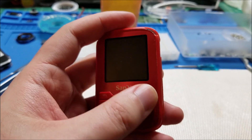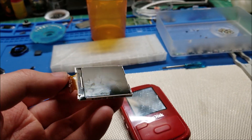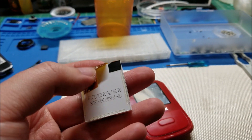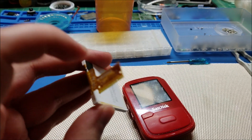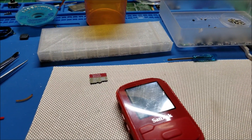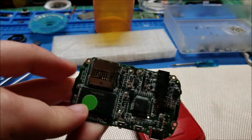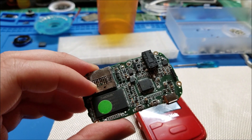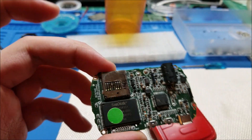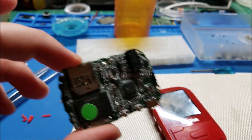When I first opened this, I wasn't even planning on making a video — I was just going to fix the screen, which I did replace. I desoldered the old screen, which had some scratches and the backlight wasn't quite so even. I replaced that, desoldered the flat flex, and took one from a slightly older Sansa Clips Sport. This is the old board for that — it mostly works but it has pretty bad water damage, and the SD card slot is really intermittent because the contacts are kind of iffy. You can see there's a lot of white chalky stuff all around. This board mostly works but not really — it'll randomly crash and the battery doesn't charge on it anyway.